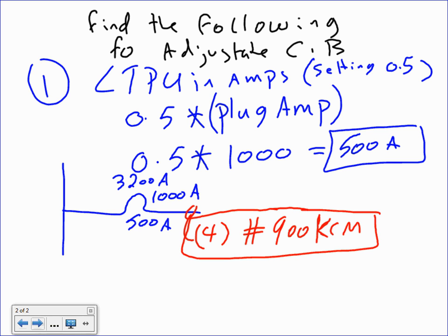In this particular example, isn't it a little bit dangerous to have a breaker that's adjustable from 500 to 3200? Because if somebody turns that, then you're going to break. There's rules for the code. In order to size based on the long time pickup, the adjustment has to be locked behind closed doors, or the room has to be locked and only authorized people are allowed to walk in. Like the room that we walked in, guys, those are all electricians and only authorized people can walk in, because you don't want somebody with a screwdriver tweaking them up and down.